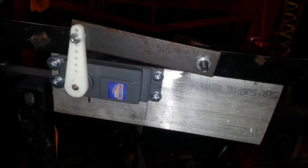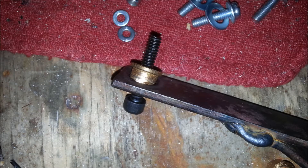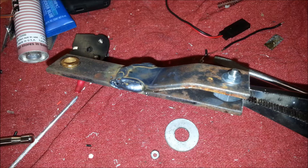Here we're looking at the aluminum mount, the giant RC servo, and the steel connecting arm. The giant servo is from hobbyking.com. Taking a closer look at the connecting arm, we have a bronze bushing that mates up really nicely with a close-fitting shoulder bolt, some copper spacers to deal with the clearances, and then we added a little tab on there to equalize the forces transferred from the plastic servo arm to prevent any bending moments and damage to that arm.